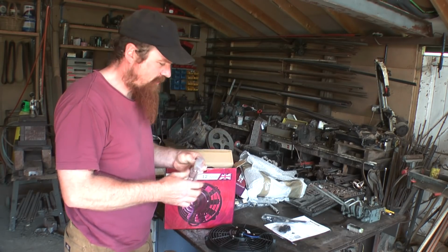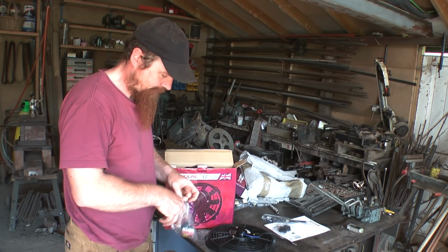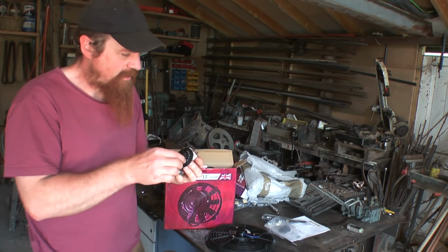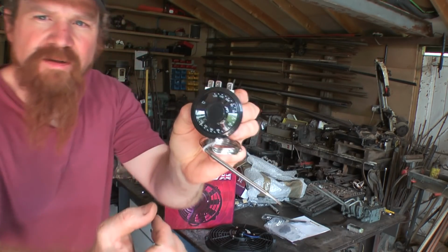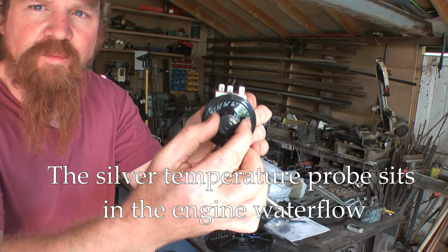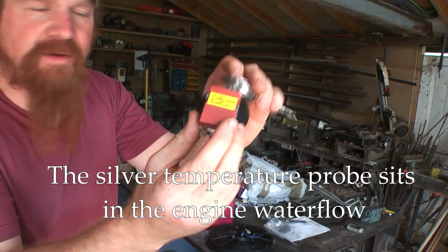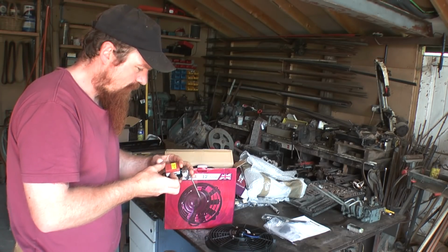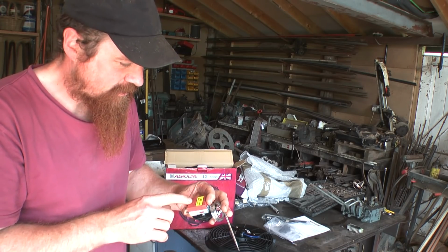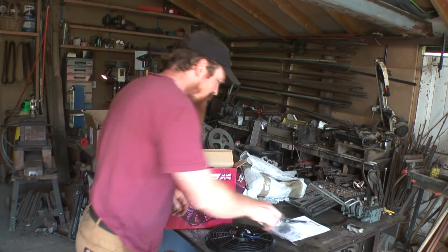And this here is the thermostat. So it's completely independent of anything else on the truck. We can set a temperature for the cut in there, and it's just a relay switch on the back. And it says on the relay 20 amps, 250 volts, so I think it's going to cope with 24 just fine.